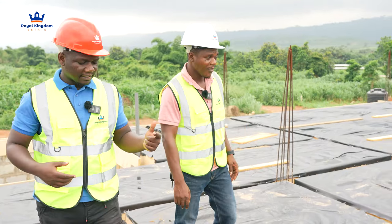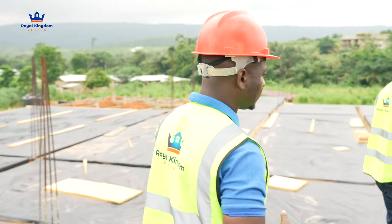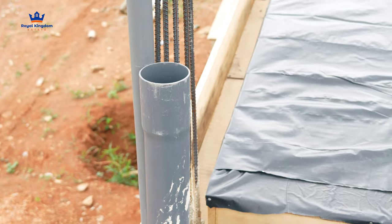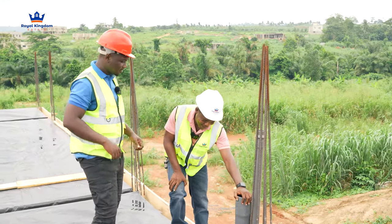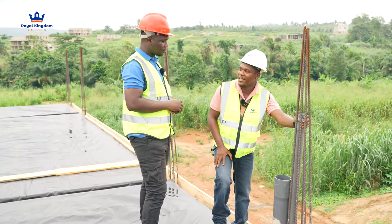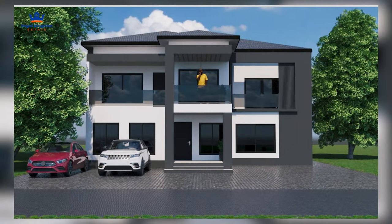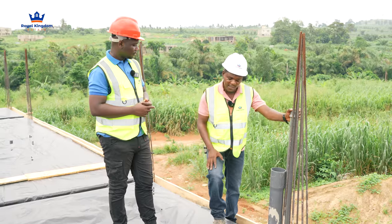I'm seeing some pipes that have extended to the top. These are the pipes that are going to shed off the waste. The four-inch ones — these are all pressure pipes. This is going to take care of the WC, and this one is going to take out the waste from the wash basin and bath areas — the gray water. The plumber will come and shoot them off to the required measurements as to where the pipe will be, then we will cast.